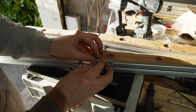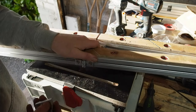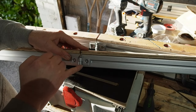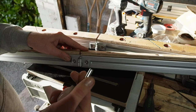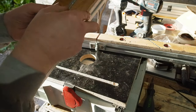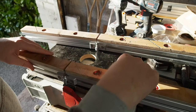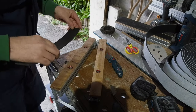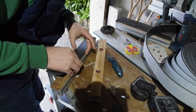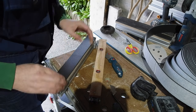These hinges join two profile pieces together, allowing them to articulate. They're supposed to mount profile parallel to each other so weren't really fit for the task, but I figured I could just cut these in half with a grinder and replace the pin with a small bolt — a bit more waggle than the original, but does the job. I'm also adding another sacrificial layer using some rubbery foam acoustic deadening — the self-adhesive type used under floor slabs. Cheap and effective — I only need some in 50mm strips so I trim it with a Stanley blade.